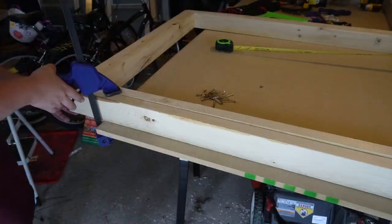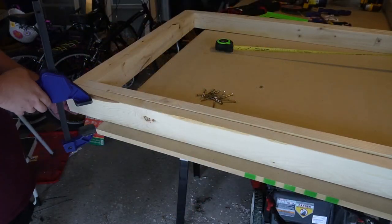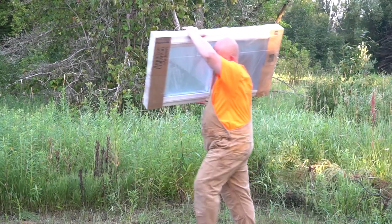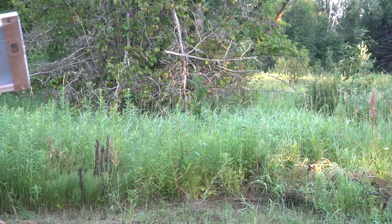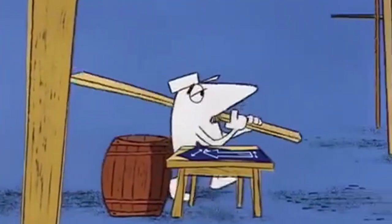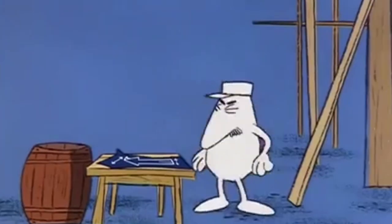You can see the frame I made — it's very simple, basically a double 2x4 box for each opening. You get the dimensions of the rough cut-in from the instructions on each window and each door. Trust them — don't try to overthink it; go exactly with what they're saying. When you decide how you're going to cover it, that's where I trusted another YouTube channel. He made it sound so simple, but he might be a contractor with access to other equipment and metal that I didn't have.